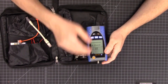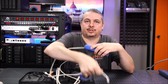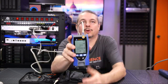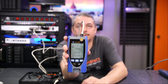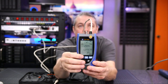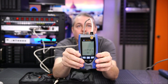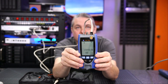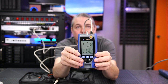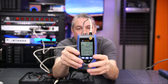Let's jump into the PoE testing. I'm plugging in heavy-gauge Cat6 shielded, high-quality, properly-crimped cable to port 8. Now we watch it work its magic. 54 volts, 29.9 watts. The checkmark means — based on class 4 — it is providing the proper voltage. We'll hold the button for a few seconds for the extended load test and wait for a beep. Now loading: still 54 volts. 30.1 watts at 52 volts. So now we know it's not only claiming to do it — it's actually giving us 52V at 30.1W, passing under load.